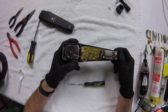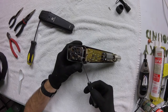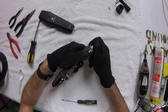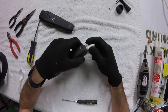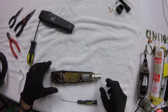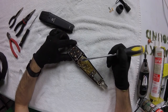Now that we've got it open, this is our diaphragm. You want to make sure to not damage this. We've got one of our resonator rings here that helps protect it, incidentally, but that's not its primary purpose, and you just want to be very careful. So I'll gently rock that out, and those two pieces fall right out. So we will be needing those later on. This is the big secret to removing the circuit board, is that this is our screw right here.